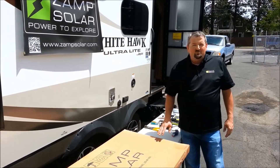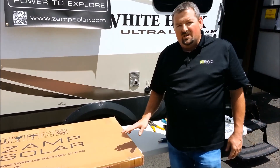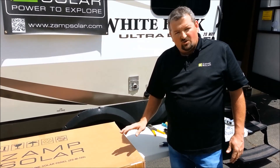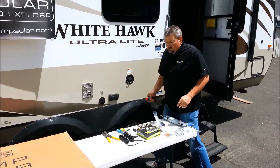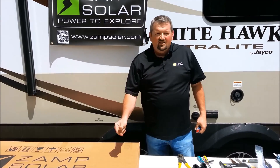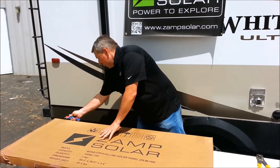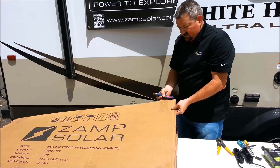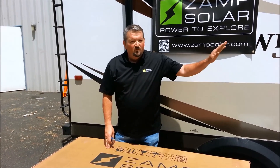We're ready to set our three-port roof cap and panels now that we've got everything wired up top. Remember to get the mounting feet on your panels before you put them on the roof. The panels come in a cardboard box — don't take the panel out and start wiring once it's in the sun, because it's going to start producing electricity immediately. I cut the edge of the box to make a cardboard lid to cover the panel and keep it taped on while hooking everything up.